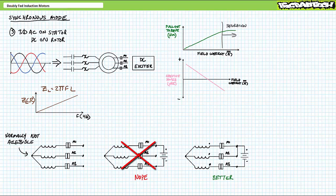One way of getting around this connection challenge is by placing windings M1 and M2 in parallel with one another, and this parallel combination is in series with M3. Given the direction of conventional current travel and the polarity markers in windings M1 and M2, this creates a shared fixed north pole, and winding M3 creates a fixed south. It's still wonky, but not nearly as wonky as 2/3 of a rotor electromagnet.